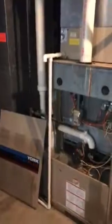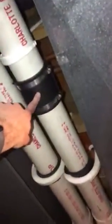The existing furnace is a 90+% unit, so we're going to go back with a 90+%er. So all of our PVC venting, you can see here, runs up and runs straight out. Looks like they're right at the limits, but they'll be fine on distance. So we're going to have to cut the pipes here. Reuse. Looks like this might have been sealed at one point. Was there ever a leak here? I don't remember. Okay. So I think it might be best to cut them both right here, and then redo it from here over, just to make sure that wasn't put there for sealing a leak.